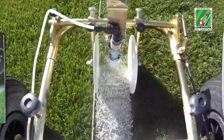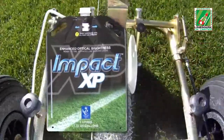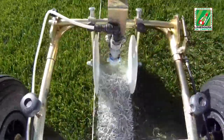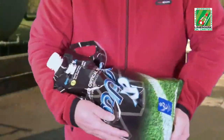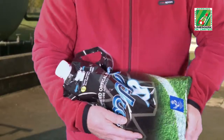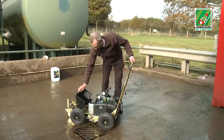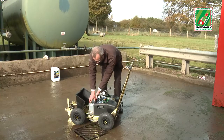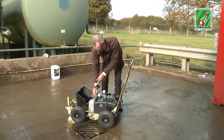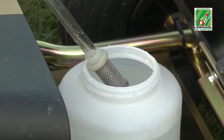Combining the Impact paint and the Argo spraying machine is the perfect partnership. At the start of a new marking operation, when using the Impact eco bag, all the operator has to do is shake the pack to distribute any contents that may have settled out in storage. The bag is then placed in the Argo section tray and the cap removed. The front machine cover is lifted to reveal the priming bottle into which the paint transfer tube is inserted. The transfer tube features a filter on the end, which prevents debris entering the delivery pipe.